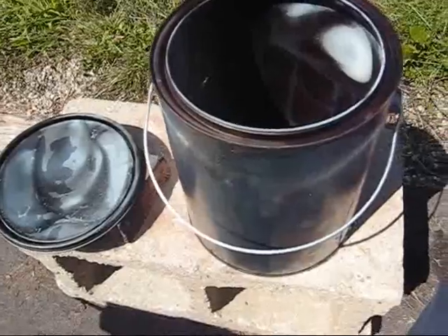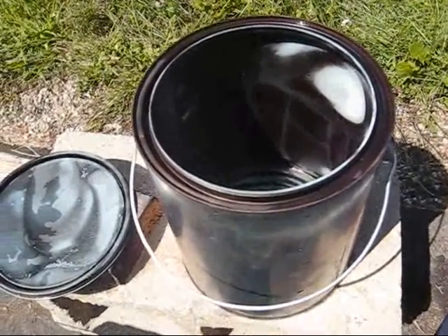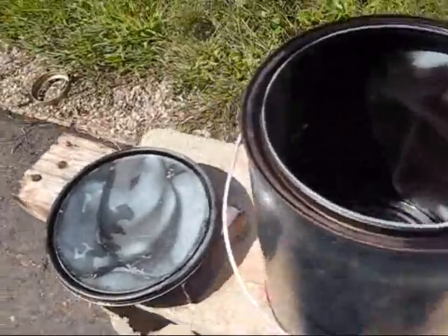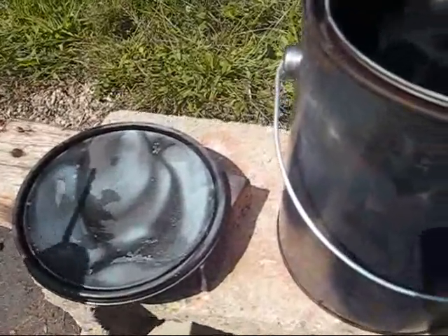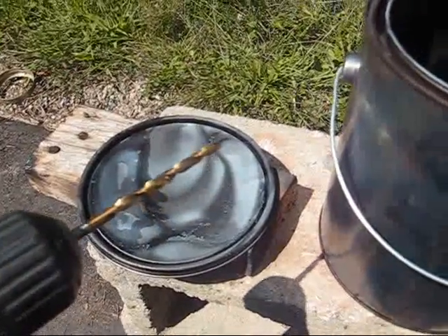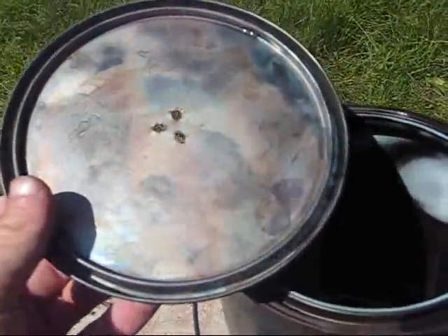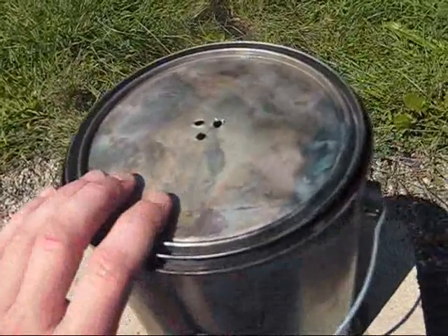After the can and lid have been burned and then given a good wash to get rid of any ash left over from the enamel on the inside of these cans, a hole needs to be put in the lid to vent gases produced by the charcoal. I'm actually going to do three holes in the lid using a 3/16-inch drill bit, but one hole in the center of one quarter inch will also do. Here is the lid, and that makes a finished crucible.